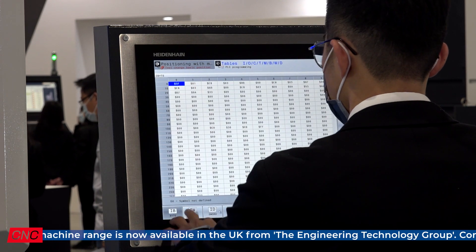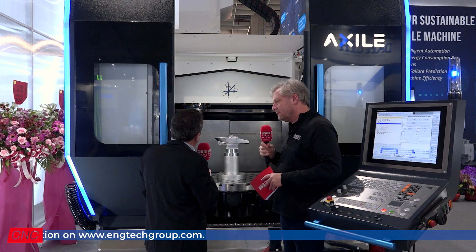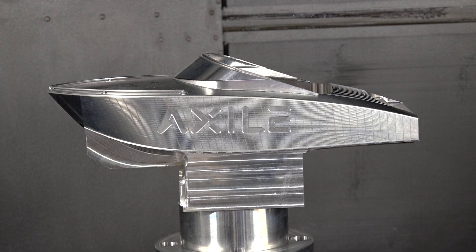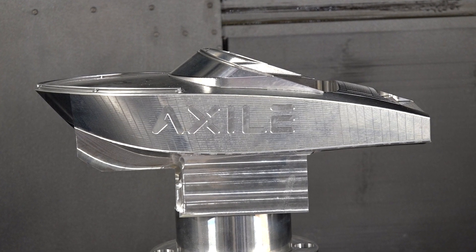That's all well and good — you've got a super fast, super powerful spindle. What about the ram though? It needs to be rigid. Yeah, that's why we are going gantry-type construction. We have twin ball screws on each side of the gantry and, again on this machine, we keep the philosophy of high speed. We move at 48 meters per minute, which is super fast for a machine like this. It's just getting better all the time, it really is.